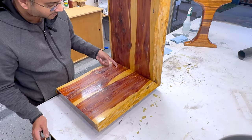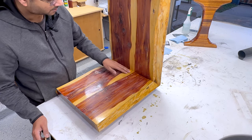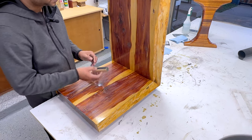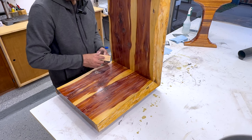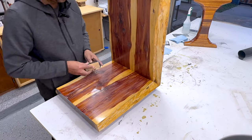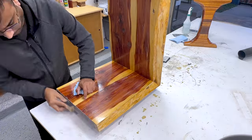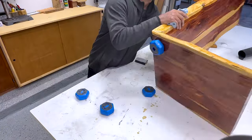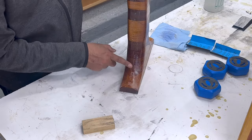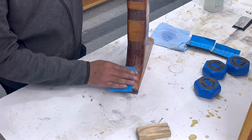I see a lot of high spots here — I think when I was brushing there may have been a lot of finish left in this area. I will sand it as much as I can and wipe it out, but this is the back side so I am not that worried. The leg is power carved so I cannot use a flat wooden block — I will be using my hand to sand it.